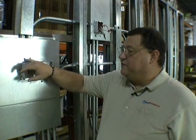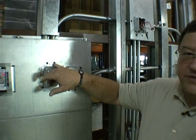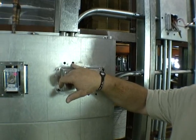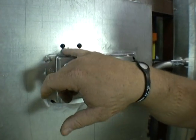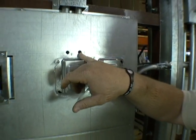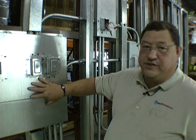You'll notice that we've drilled some holes in this mounting plate. What that allows us to do is to tighten our set screws on our conduit connectors behind the wall. We know that everywhere there's a hole, there should be a conduit coming into this box. These holes will be punched at the time that we punch this plate.